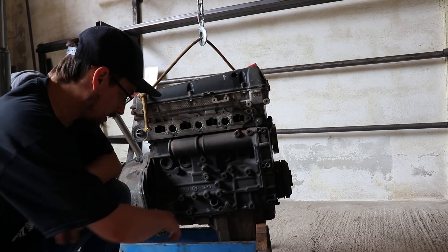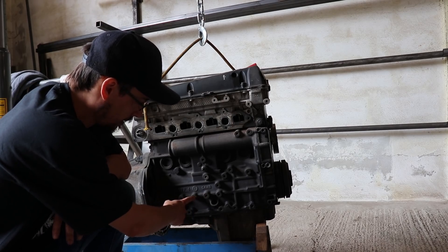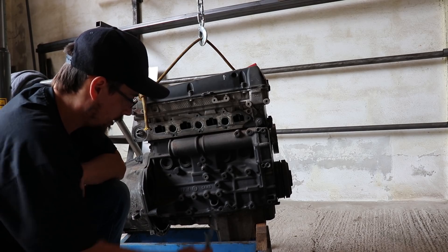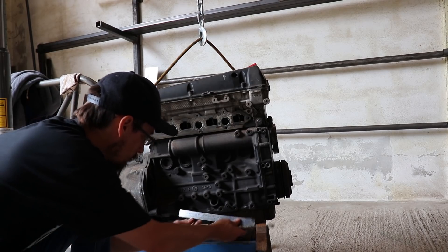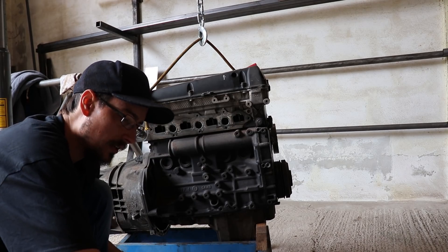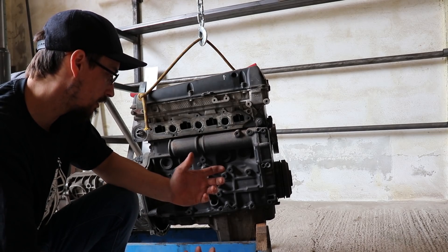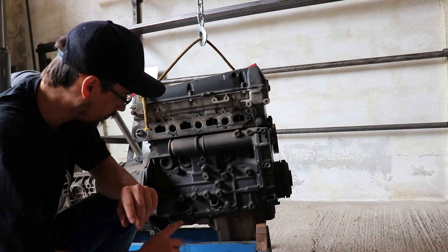What I've got here is basically I'm looking to make a plate for an engine mount, and I'm wanting to use these four bolts which are a funny sort of offset. If you try to measure it and then transfer those measurements onto the plate, it's quite tricky. Trying to square that off with a vernier, you can do it but it's pretty long-winded and you never get it exactly right. You end up having to drill one hole slightly bigger, and then you end up with one big hole with a little bolt flopping around — no fun for anyone.